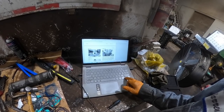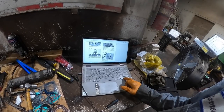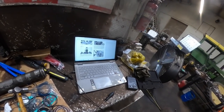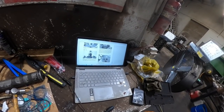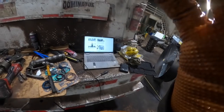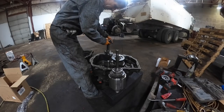Install the four-wheel drive clutch gear so that the lugs are up. We did that. Okay. Connect acceptable lift equipment to the top gear on the secondary shaft. Lift the secondary shaft over the rear of the housing. Engage the shifter forks with the synchronizer as shown. Begin to lower the assembly into the rear housing. So I haven't got the shift fork set up yet, so I got to get that set up. Okay. These kind of have to be going in as a pair.